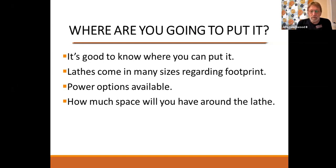What power options do you want? If you don't have 220 available, then you need at least a 15 or 20 amp 110 dedicated plug, or else you will probably wind up tripping your breaker a lot. Trust me — when you're doing that final last cut and the breaker trips, it can be frustrating.